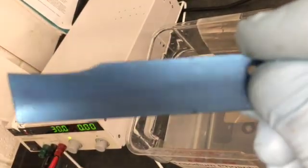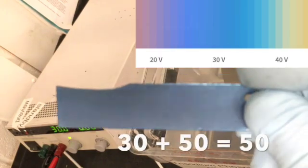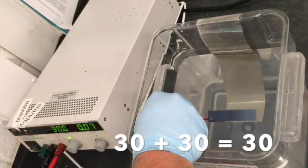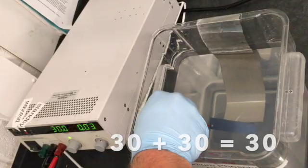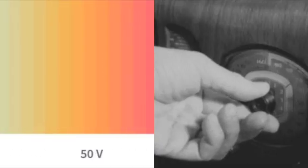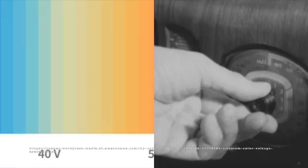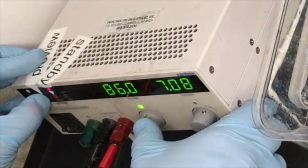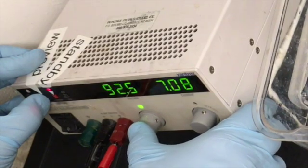On the flip side, the thickness of the oxide is determined by the voltage and, weirdly, is not cumulative. So if you shock your metal to 30 and then to 50, you get the color at 50, not 80. Or if you only shock half the piece to 30 and then shock the whole piece to 30, the whole thing will be very close to 30 — not 30 at one end and 60 at the other. This matters because the process is one way. If you overshoot your color, it's difficult to correct it; you can't simply turn the voltage back down and tune the color like a radio. But you can always turn the voltage up. My suggestion is to always set the voltage to 10 volts under the desired color and creep your way up a few volts at a time.